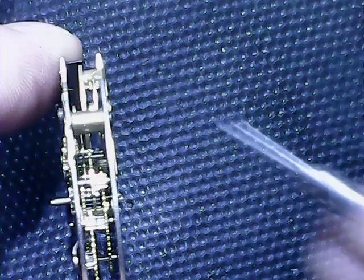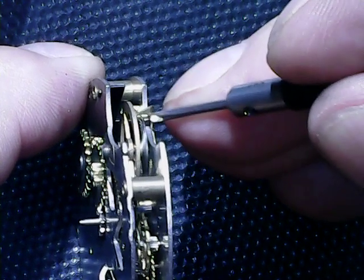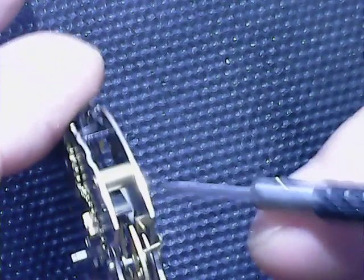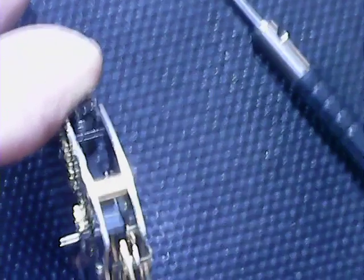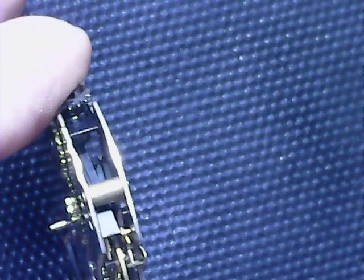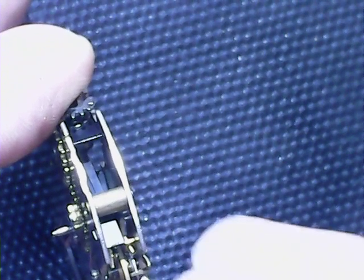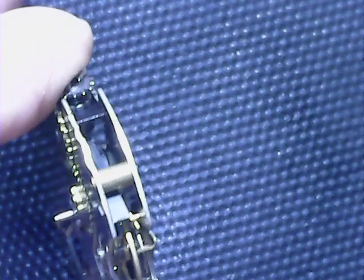Right, I just need to have a look. Right. Okay, so the hairspring. I can get this to focus kindly. The hairspring goes through there. Usually there's a hairspring stud where the hairspring fits into the balance cock, but on this, the actual balance cock is the bottom pivot. Let's see if I can get this into focus a bit more. There, you should just about be able to see that. That pin goes through and the hairspring is running through that part of the bottom plate.